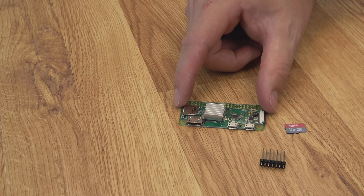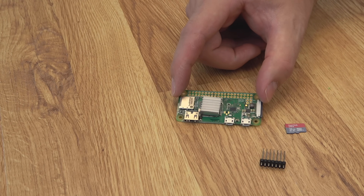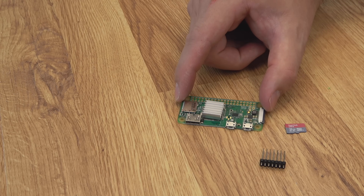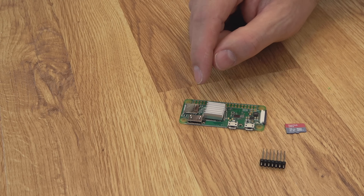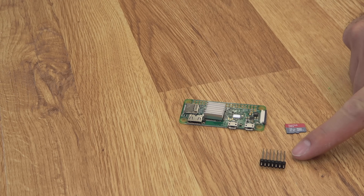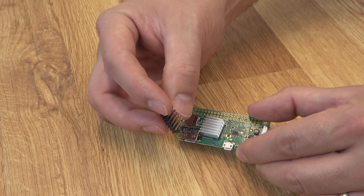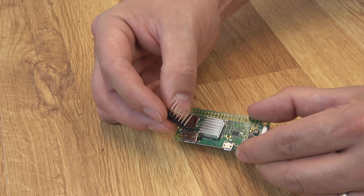A Raspberry Pi Zero or Zero Two is going to be preferable because you can plug these directly into the back of the board. Of course the Two is going to be much faster. You need 18mm pins to connect through the board — they have to be pretty long, so make sure they're 18mm. Links to all this are in the description. When you get your pins, I recommend you go with the doubles, just so they have a better footprint.